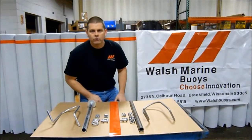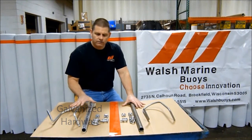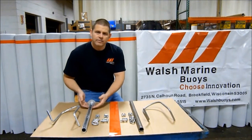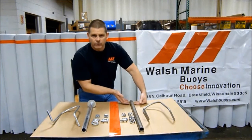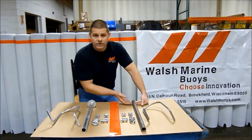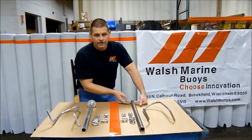In making your hardware decision, it's important to note the difference between stainless steel hardware versus galvanized hardware. The full accompaniment and sizes are available in both stainless steel and galvanized. Galvanized typically would be used in fresh water applications, where stainless steel it would be imperative to utilize in a salt water or brine application. Certainly, stainless steel can be utilized in fresh water as well, this being the epitome of hardware from a strength standpoint as well as a longevity standpoint.